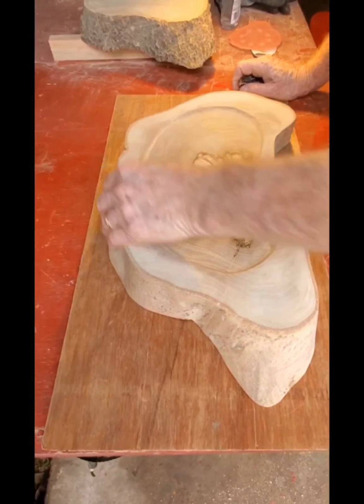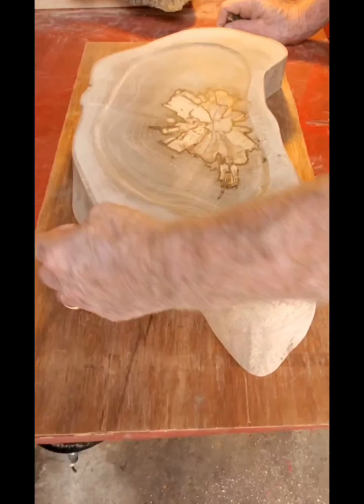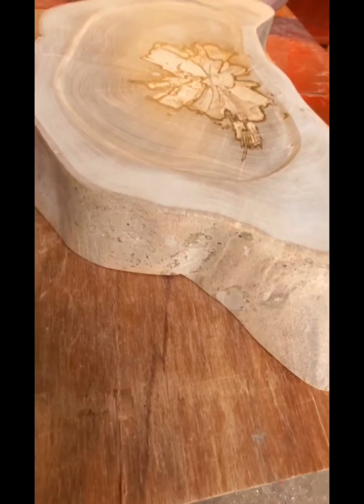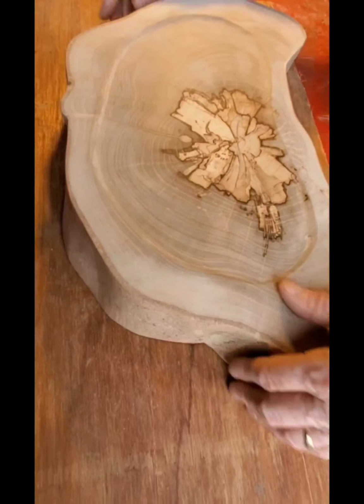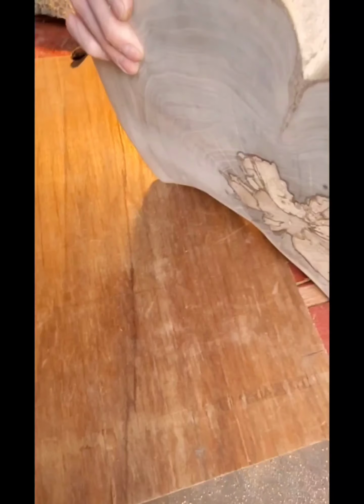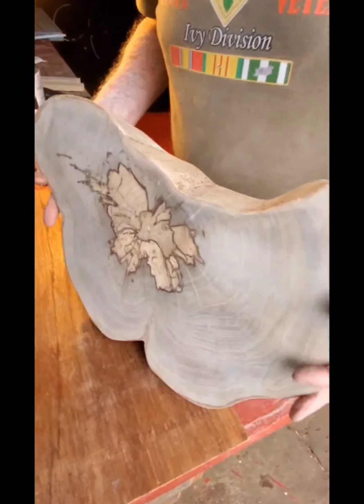In the first pictures we had of it, it was all real rough bark, knotty nubs all over it. I chiseled everything off of it, and then used rough sandpaper and sanded the whole outside edge of it, all the way around. It left some holes that were part of the wood, because this is natural wood, and I filled all of them and sanded it all out.